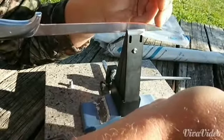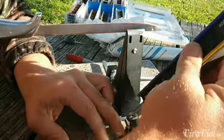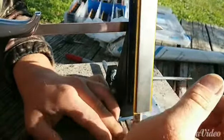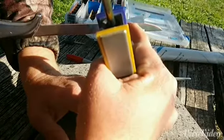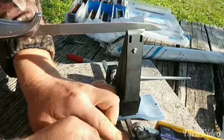Just go down the edge of the blade. Loosen up your bottom adjustment screws so it slides freely along the bar, and eyeball it to start off using the finer stones. You can see that it's hitting the lower part of the bevel, so we need to come back a little. Move back, take another swipe, and we're there.